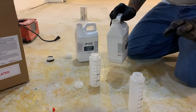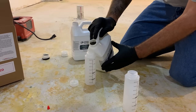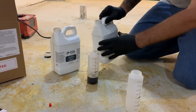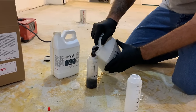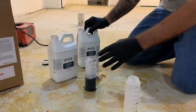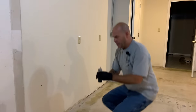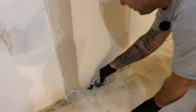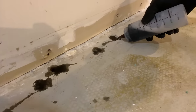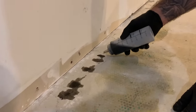Part A and part B — this is a one-gallon kit. I don't have anything on the floor because we're going to be grinding it; if you have a finished floor put cardboard down first. Two ounces of part B — and this is why I use cardboard. So here we go around the perimeter. These holes — this stuff is very thin — I'm just going to run right around and slightly overfill each one. I'm just working my way right around the perimeter; this is all going to be ground off, so even if it's high it doesn't matter.